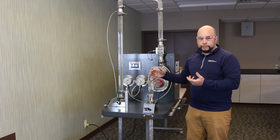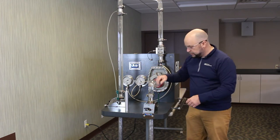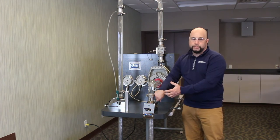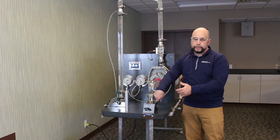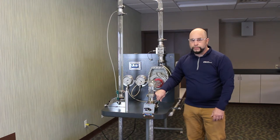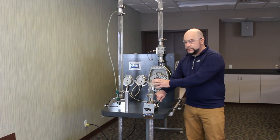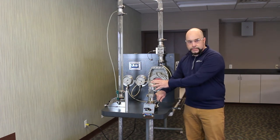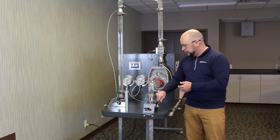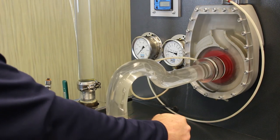Imagine if this was the pump you just installed with a suction side strainer upstream of it to protect it from being damaged. But as time goes on, if you're not monitoring and maintaining that suction side strainer, you can imagine what happens — the strainer continues to get more and more plugged, which causes higher and higher suction side losses. As we talked about with NPSH required versus NPSH available, you can start to cross that zone in which you actually cause cavitation in your pump.